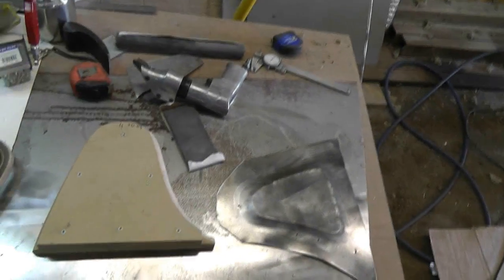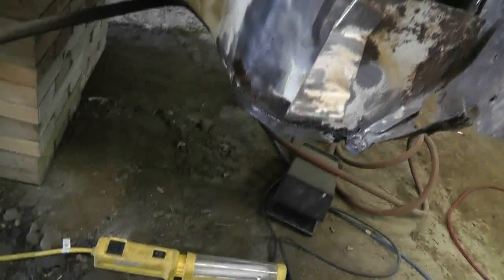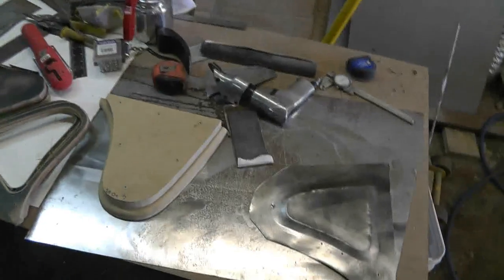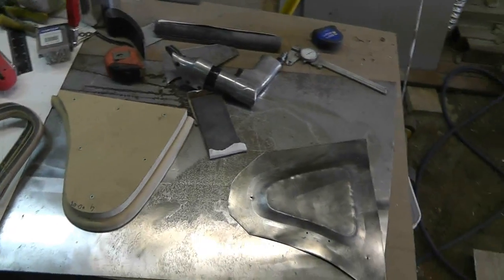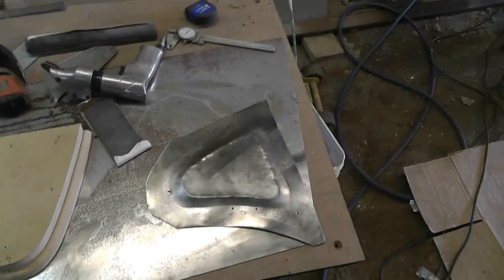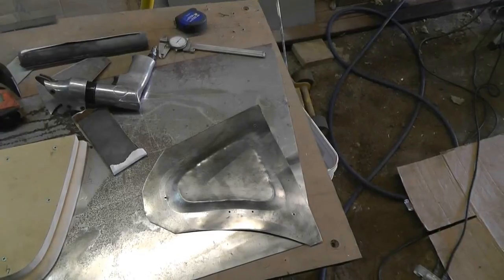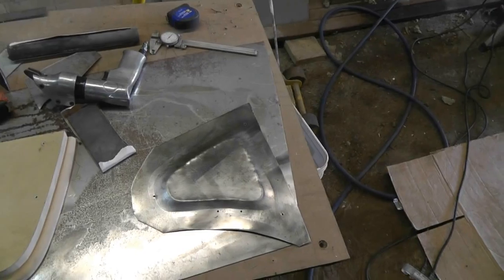This piece here was also a hammer form used to form the lip as it comes down and around here, so I could rebuild that — it wasn't a very refined idea. Anyway, it's now about two in the afternoon on Sunday and I have to figure out what I'm doing. I do have a bead roller — I could try forming that with it, but I wouldn't be able to form a half-inch deep one unless I want to turn new dies for the bead roller.